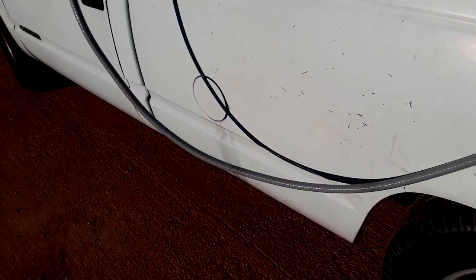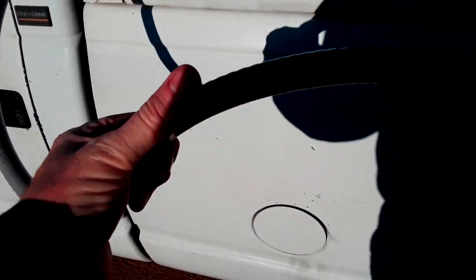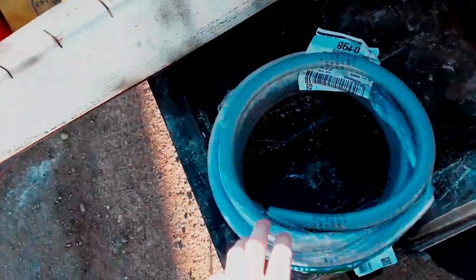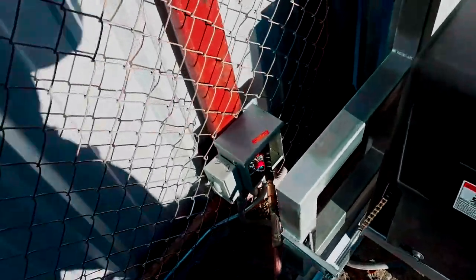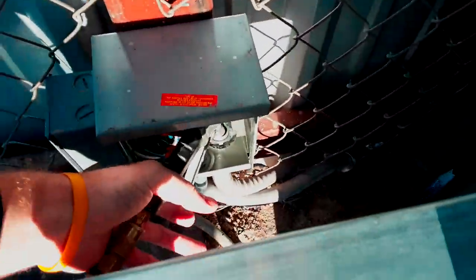Setting it in the sun and then straightening it out will help. We'll blow this out right now and see what it looks like on the other side - we went from dirt in the conduit to no dirt. We're going to have to go from three-quarter inch down to half inch and make some bends, which is why we want to pull the wire first. I'm going to put the fish tape through this side - I'd typically use a metal fish tape but I only have a fiberglass one; we've broken two metal fish tapes in just as many months.